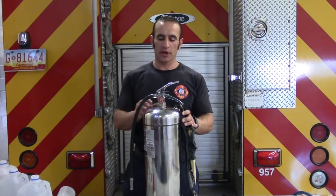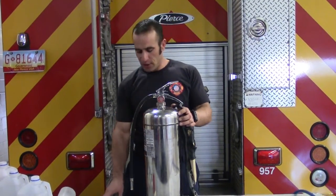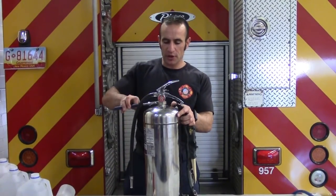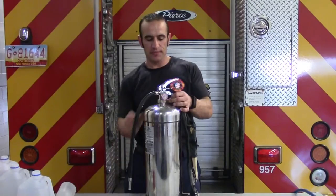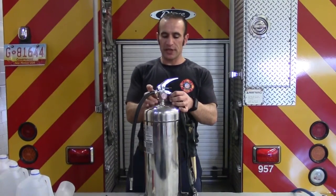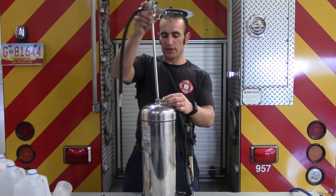In this video, we're going to cover how to refill a portable water extinguisher, or for short, a PW. Get a pair of channel locks, and you're going to start with loosening the nut by the handle at the top of the extinguisher. You want to loosen that nut all the way, and then remove the handle completely from the extinguisher.